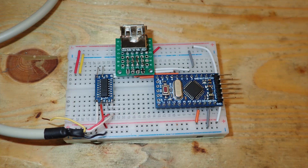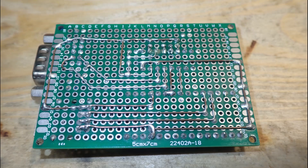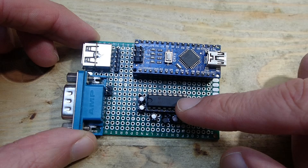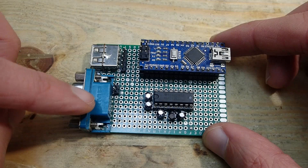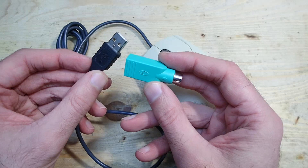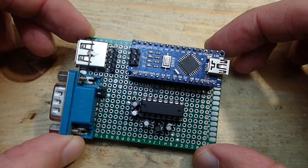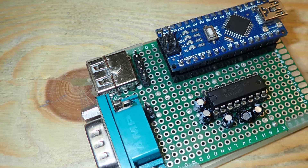Back to the PS/2-to-serial adapter: I wrote some simple software for the Arduino and made a raw setup on a breadboard. After some minor issues I had a working solution, which I then implemented on a piece of prototyping board around an Arduino Nano. Here is the Arduino itself — the whole thing gets powered through the mini USB port directly on the Arduino. Here is the MAX232 IC with all the capacitors which translate TTL voltage to RS-232 levels, the serial port, and a fake USB port. Since the Logitech mouse is USB-capable as well, instead of using a PS/2 port I directly used a USB port and wired everything accordingly — I had no spare PS/2 ports at hand anyway, but plenty of USB ports.